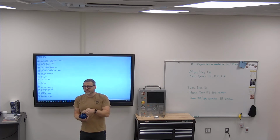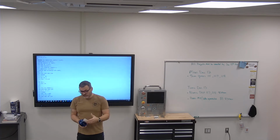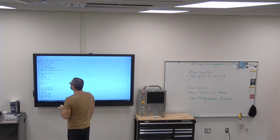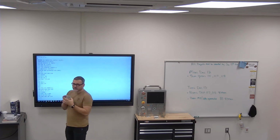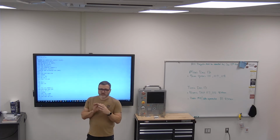So this just makes repetitive stuff. And why you're doing this is because when you get to multi-axis stuff, a dovetail will hold 80% of the parts, or pretty much a dovetail. So the top of this print or part says X0 and Y0 are in the center of the part. We're going to use probing for that. We're going to use a probe cycle to do X and Y.